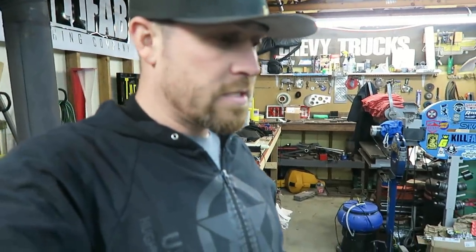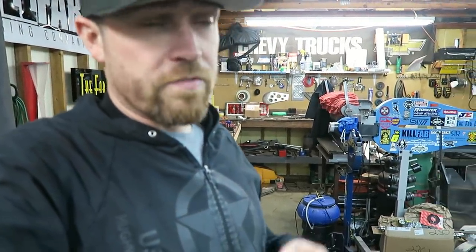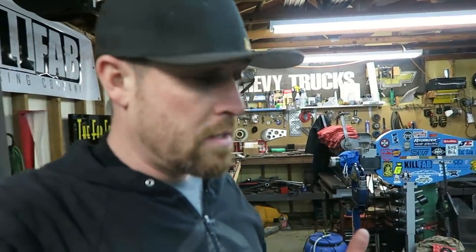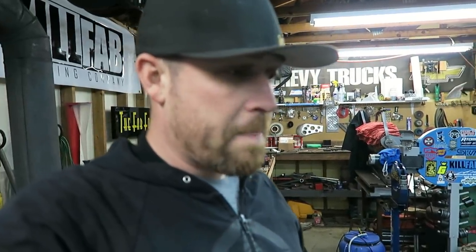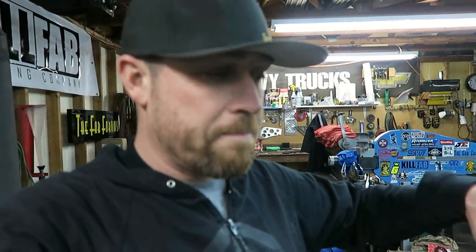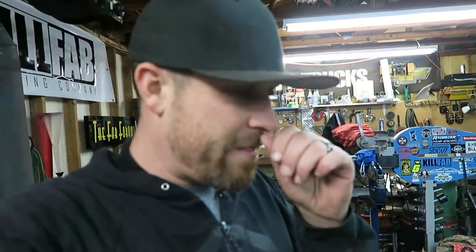I'm actually gonna run it on this particular setup for two reasons. One, the reason we just talked about, to save any unneeded stress on these cantilevers. And two, because I plan to have the rear section of this chassis fit ultra tight to the tires when it's laid out, I don't really want to give it any room to kind of sit on the body or whatever.